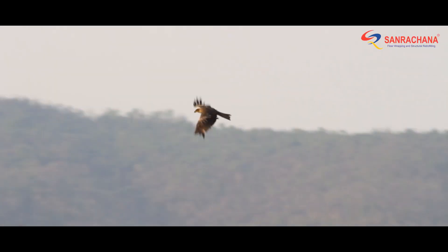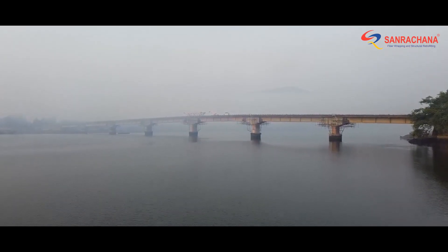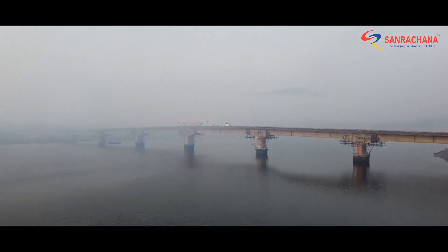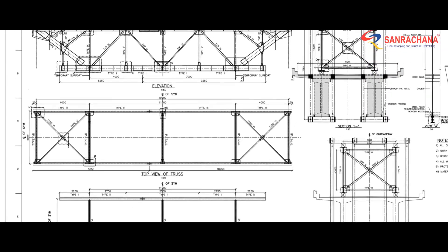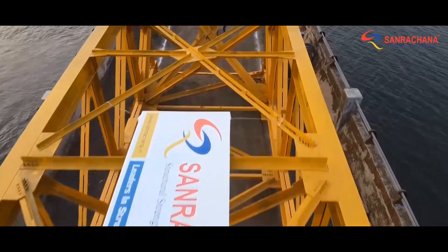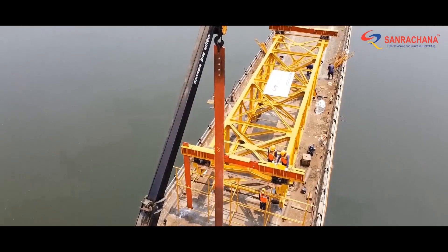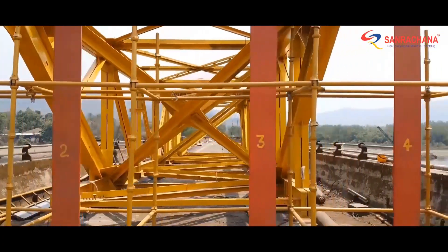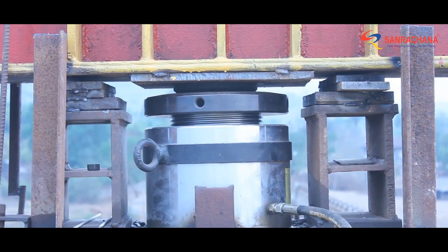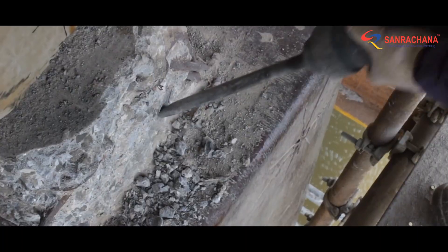Now the most challenging part — replacement of the bearings and the expansion joints. Since conventional jacking systems were unsuitable for the architecture of this bridge, our engineers were back to the drawing board. Several brainstorming sessions later, we came up with this ingenious solution: a truss system custom-built to suit the varying dimensions and asymmetry of the six different hammerheads. Once assembled and moved onto a hammerhead, high-strength plates are passed through the deck to form a cradle system supporting the spans on either end. The cradles were rested on powerful hydraulic jacks on top of the truss ends, and the spans were then lifted gently with utmost care, creating the separation space for replacing the old defunct bearings with new ones.